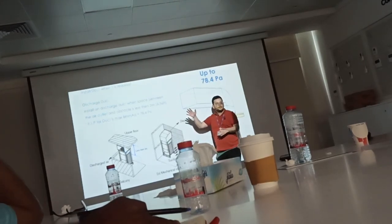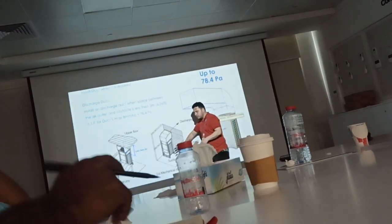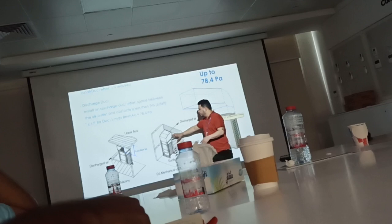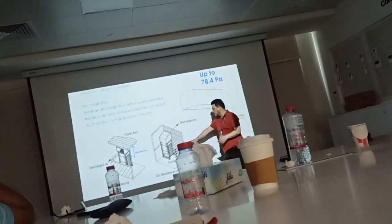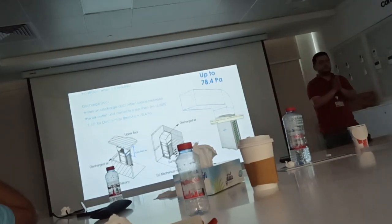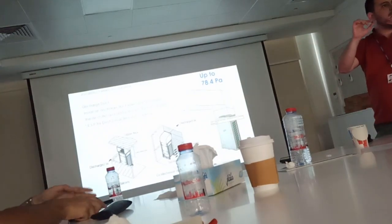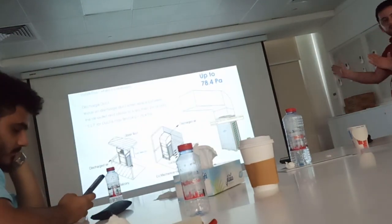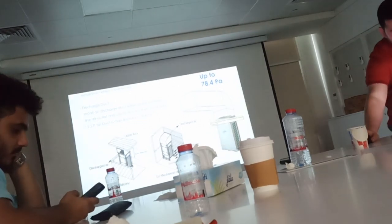This is a high-rise building. They are using mechanical floors. So if you have this case, you also need to fix the outdoor unit with a duct guide to outside, and this louver has specific requirements. How much opening it should have, what the blade type is, all these things should be considered in these cases.